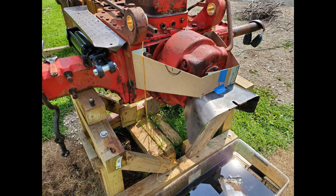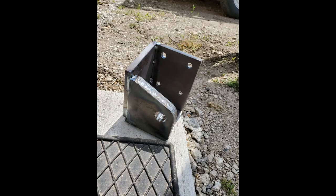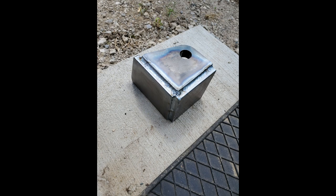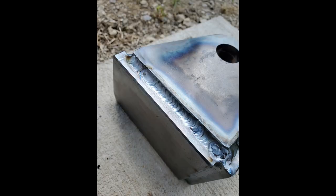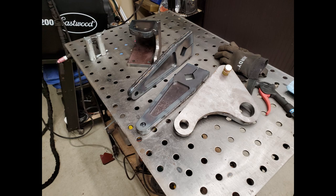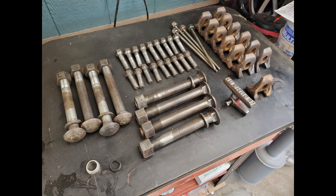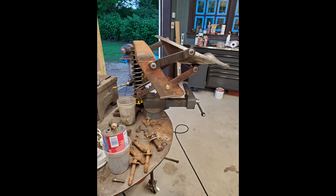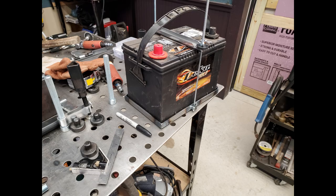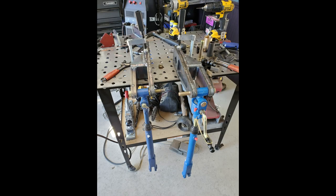I first located some bronze bushings that pressed into the features on the frame casting and sourced a cylinder from a hydraulic supply. Measurements were made for the dimensions of the hard mounting points, and using cardboard mock-ups I made rough templates for various brackets that could be translated into CAD. These CAD models were used to get laser-cut parts made out of steel, shipped right to my doorstep. These cut pieces were assembled and welded together to make finished brackets that would later be bolted onto the frame or welded to create rotating linkages, all working together to transfer the linear motion from the hydraulic cylinder into rotating motion of a rock shaft. New axle seals were installed and all the hardware for the hub and wheel attachments cleaned and added to the steadily increasing pile of parts ready for paint. The deluxe springer seat was reassembled using a bearing kit, as all the original moving parts were either seized or worn beyond use. The battery tray was fabricated from steel angle, and more welding and fabrication was done on the various hitch components, mounted in place to ensure proper alignment and access to nearby parts.